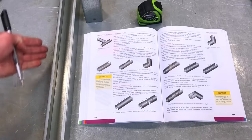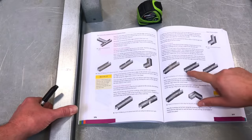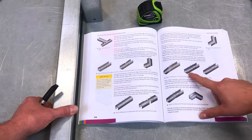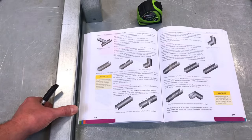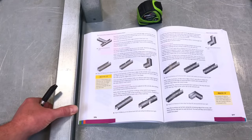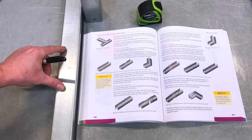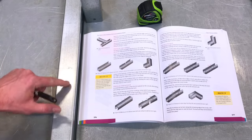So we're coming this side, yes? Yes, so therefore, unlike the drawing in the book, by performing the cuts it states here, we will actually pull the bend to the right. Okay. So we're going to have to put our marks B and C on the side you've got shown there. So we're working on this side because we're going to be bending it this way. We're going to be working with the next two measurements, both B and C, on this side of the trunking.